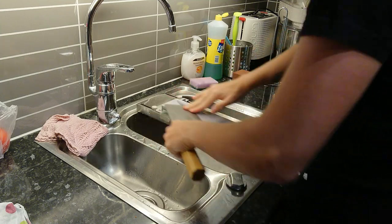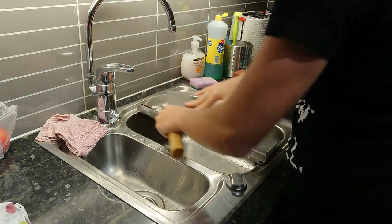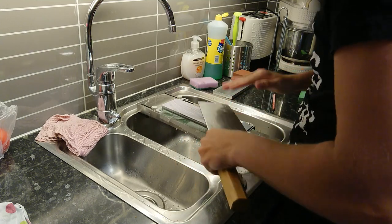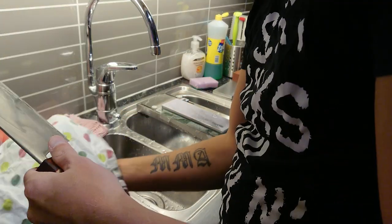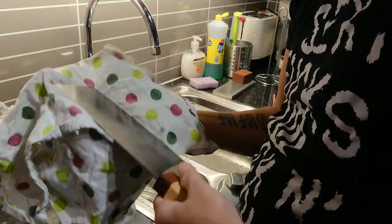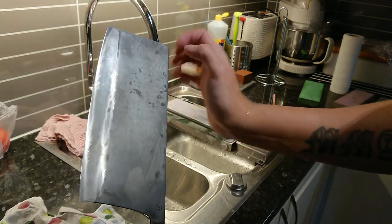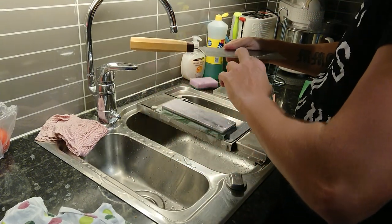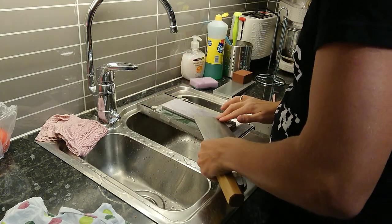Thinning now to remove the shoulders and to blend the very edge. I'm not using much pressure. Taking off the shoulders where the hollow grind begins and smoothing everything out. If you wait a minute, you can see. You see, I'm starting, I'm hitting here and down here. I haven't hit a burr yet, so I'm just gonna continue.